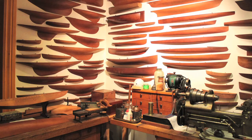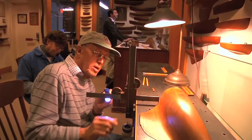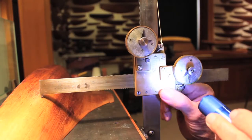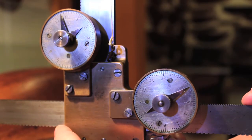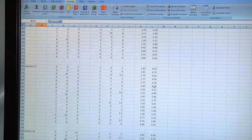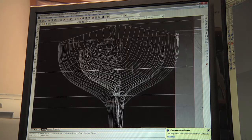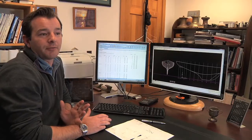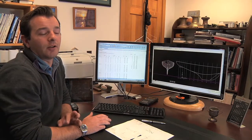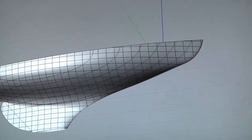When we lift off in the model room, taking the two-dimensional offsets off the model using Captain Nat's offset reading machine, we transfer the numbers into a spreadsheet, which we use to convert them into two-dimensional lines that represent each section of the boat. These lines each represent essentially a frame in the boat, and that's what defines the hull shape. Once we have the hull shape, we can create a 3D model.